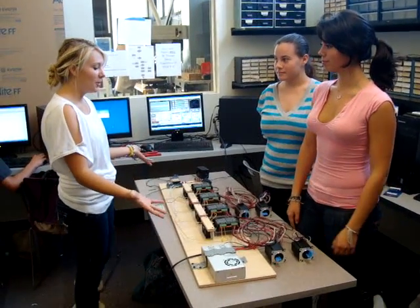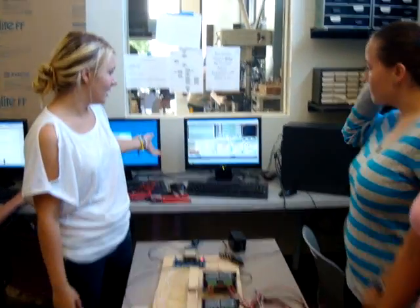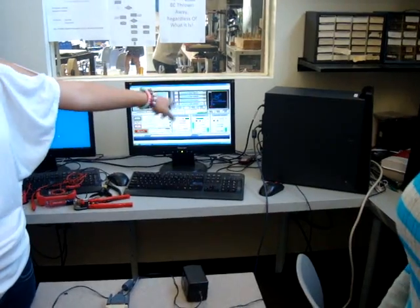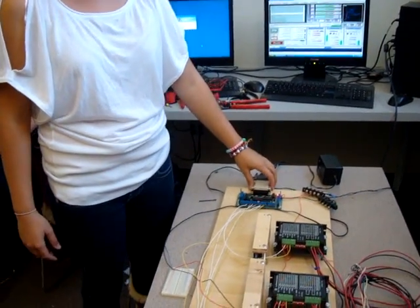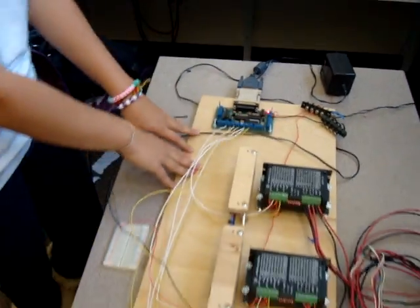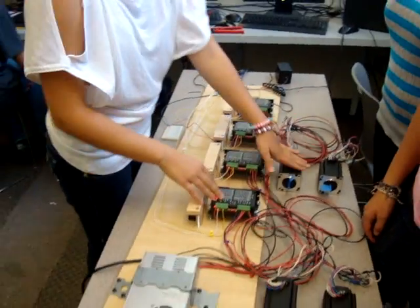Before you, it's our control electronics. What happens is our program, Mach3, sends information to the CNC computer and pins it out through the parallel printer port. The parallel printer port is connected to our breakout board. The breakout board takes the information given from the computer and feeds it to the drivers.